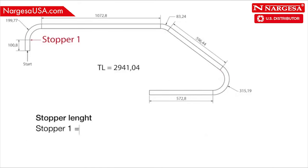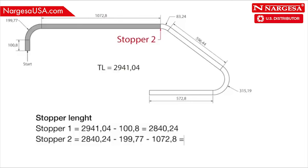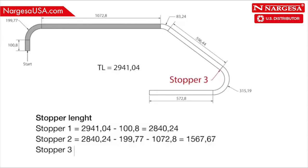For stopper 1, start with the total length and take away the 100.8 millimeters for the first section. Total, 2,840.24 millimeters. For stopper 2, start with the 2,840.24 and take away the following sections of 199.77 and 1,072.8. Total 1,567.67 millimeters.